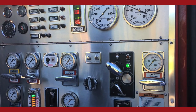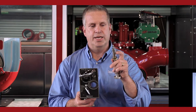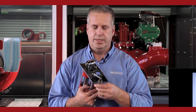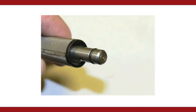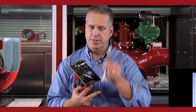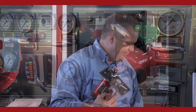Okay, valve's in the off position, take the strainer out. Okay, at that point, clean the strainer. This is a Monel screen, so just clean it out. Make sure the cross hole is clean. Make sure the hole in the very end is open. Okay, clean it off, blow through it. Take a small piece of wire, run it in there. Make sure that's clean. If that's plugged, you'll get a valve that'll hunt. It'll open and closed. Or it'll be very slow and sluggish to respond to go back to the closed position. But take it out, clean it, make sure the O-rings are in good condition, set it off to the side.